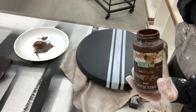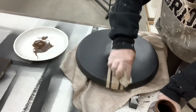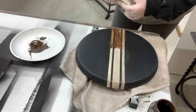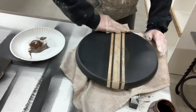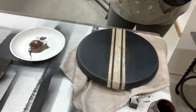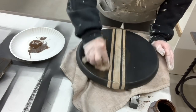I'm usually a fan of distressing pieces, but because of the technique I'm going to be doing on this white with the Waverly Wax — I love that stuff on black pieces — I want to kind of age that white. Because I'm putting it on pretty fresh and the paint isn't cured yet, just dry to the touch, the Waverly Wax rubbed onto that white is going to act like a sanding and kind of distress it. I don't want that crisp line; I like my pieces to look aged. If you want a more crisp look, just let the paint cure or put a little polycrylic over the top of the white. Then I'll proceed waxing the rest of the black piece — I just love what this Waverly Wax does to black; it just richens it up.